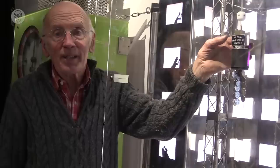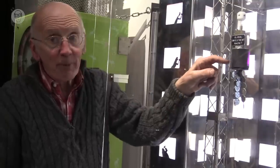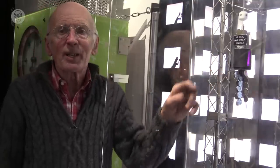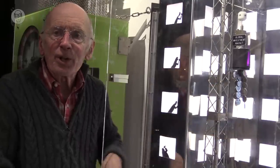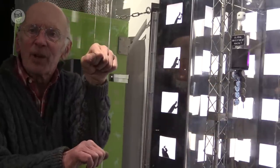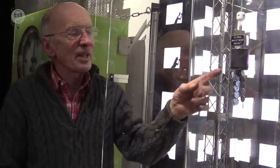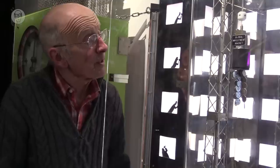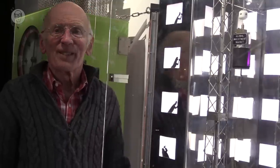So in here, there's a little pneumatic ram, a little cylinder, pulled up by a rare earth magnet on the bottom of the cylinder. And then there's a thin titanium plate underneath that they're actually touching. So when I retract the rare earth magnet from the titanium, it reduces the magnetic effect on the coins, and so they drop. It's very satisfying.